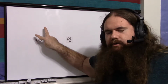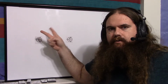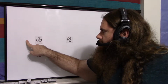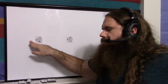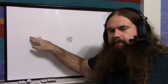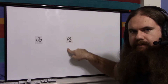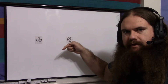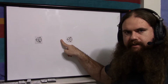So basically, try to apply a reasonably small current one direction and then the other. If it goes one way, then you know it's a diode that way. So for example, for the NPN, if you put current from base to emitter, let's say 1 volt with some small resistance, then you'll get current going from base to emitter, but not emitter to base. And then you'll get current going from base to collector and not collector to base. For the PNP, it's opposite. PNP, so you've got a PN junction there and a PN junction here. Again, the arrow is pointing in the direction of one of the two PN junctions. So if you apply current from emitter to base, it'll go through.